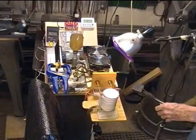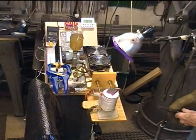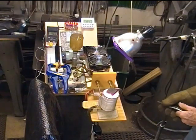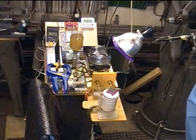And that really is the test for today. I don't know exactly how much you'll be able to see through that filter, but the surface does some moving around every now and then, but not a lot. Just one last comment — I got some solid graphite bar and cut a piece off of it, and I thought it would be neat to make a graphite cover that would actually fit down in there to exclude a lot more oxygen from the whole system to keep that crucible from going away so fast. I just got out of sync to do it and didn't want to mess up the shop with carbon all over. So I'm just going to pour this out.